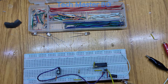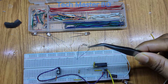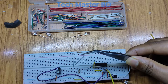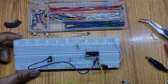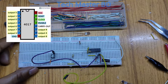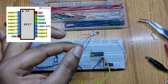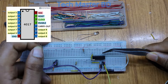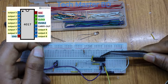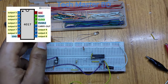For the LED ground, I have to remove this wire and replace it with a small resistor to protect the LED from the five volt logic. That's complete. Now take one LED to show the decade count with each button press. This is the LED implanted in the breadboard. I can upload the IC pinout in the description below.